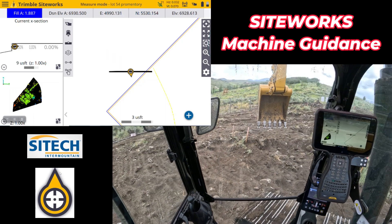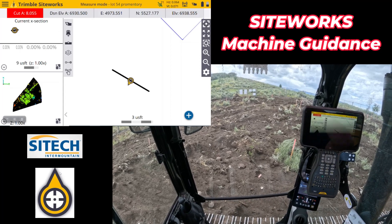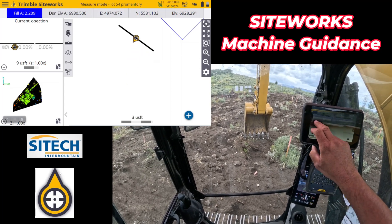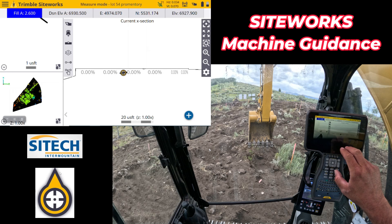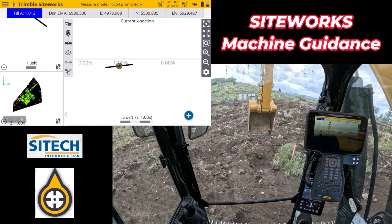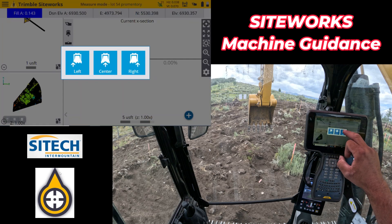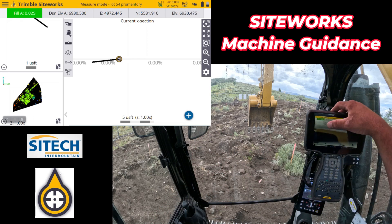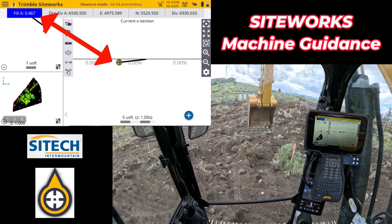The cool part is I'm actually sitting on a hillside, kind of on a little bit of a pitch. But because the machine itself doesn't have a pitch sensor or a body sensor, the actual IMU sensor is still calculating kind of a pitch of the machine. If I switch over the cross-section to the main screen and zoom in on the actual black line that represents my bucket, you can see in conjunction with what the actual surface is, I gain a body roll. So if I put it on the right side of the bucket, you can see that I'm pretty close to grade — just a little bit down. This system understands with that IMU sensor that the machine isn't sitting flat.